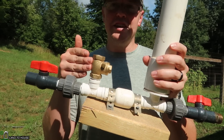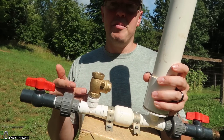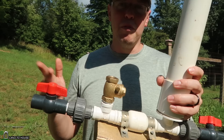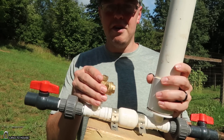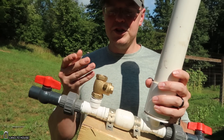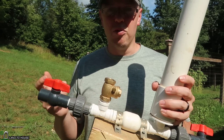The weight and size of this valve determine basically the size of the pump and the amount of pressure you're going to be getting from the pressure wave that's coming in. So it's very important to have a valve that is heavy enough to close at the right speed to give a good pressure wave.